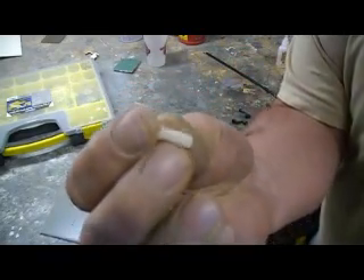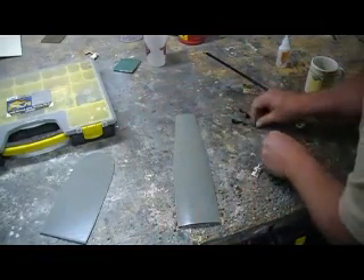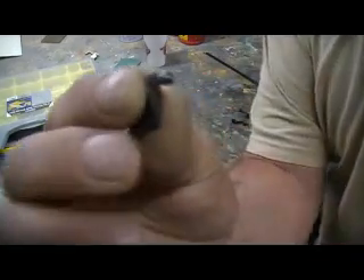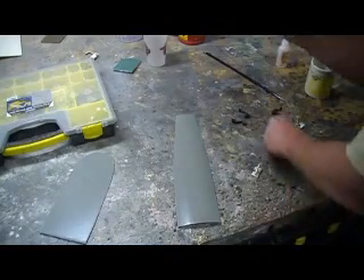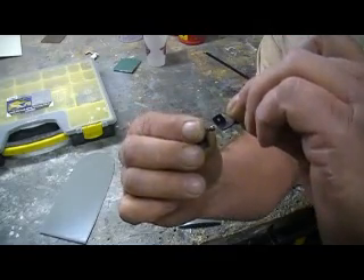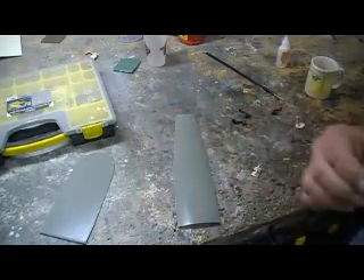In that hole there, you gotta put one of these ball link ends — most of the time you gotta trim them off, cut that about in half. Put a screw in the back side and put that in there. The other end is just a simple elbow with a ball link — a little L-shaped deal. This will allow, when it opens, if it's got a bend, when it's open like that, it'll still move freely. It won't put nothing in a bind.